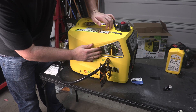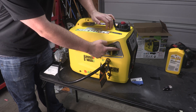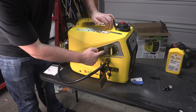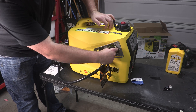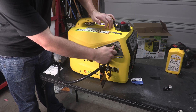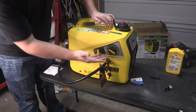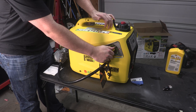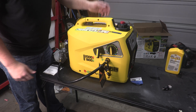Let's look at the panel. We have a pull cord here, and then we have some settings for gasoline power, which we won't be using right now, and some settings over here for propane power. You'll set it to choke all the way, start it up, and then turn the dial to turn your choke off and end up at run. There are physical detents so the button pops into position — that's pretty nice.